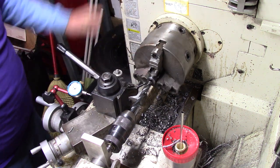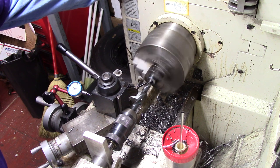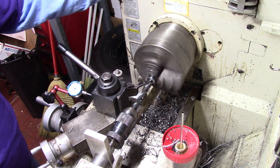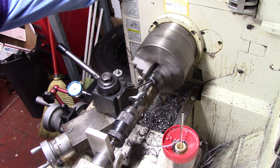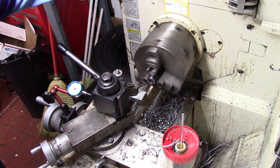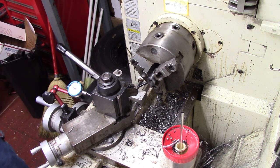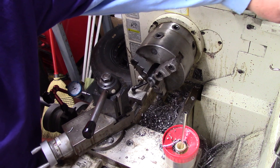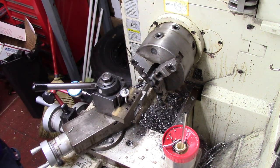I'm at 200 RPM and we're just going to do one more pass, then drill it. We're drilling it through to drive out of this socket. The customer is going to weld this stuff together, so I've got no welding to do — it's all the customer's responsibility. Now I've got a half-inch hole in it, so we're going to bore this out to five-eighths plus about two thousandths or so — minimum five-eighths, maximum five-eighths plus two. My phone just dinged, let me get back to you.